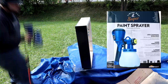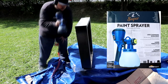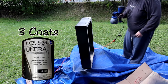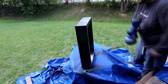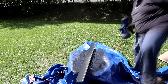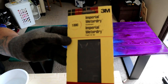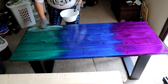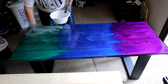This spray gun — this is what you need in your life. It's called the HomeRight Finish Max Super, and it really is super. I used it to spray the legs, the brace, and the top of the desk. Spraying that lacquer I was a little scared after the last debacle, but this thing worked perfectly — laid it on there nice and thick, exactly what I needed. Now we're ready for the wet sand. I used 3M wet/dry 1000 grit to start with and just slowly worked it on there; last time I went through the lacquer so this time I took it slow.